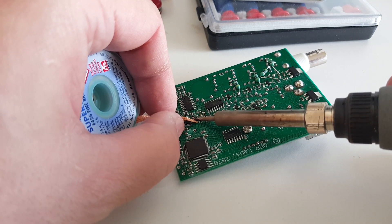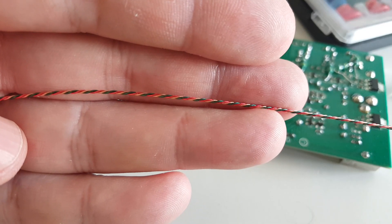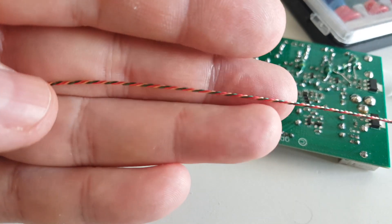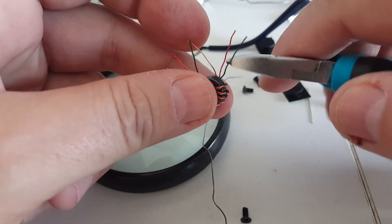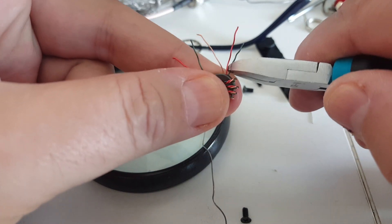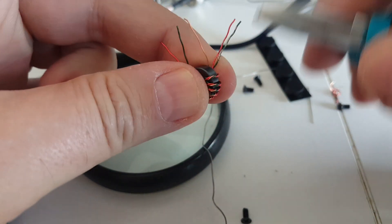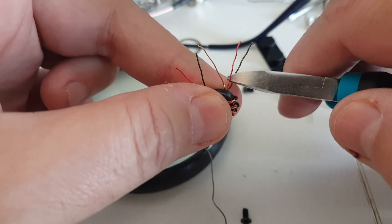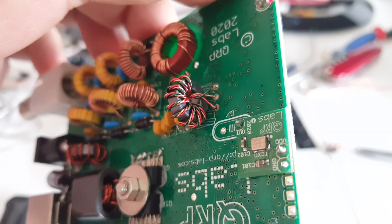I'm not sure if that's the problem — I'm just suspecting it, so we'll see. I'm also using wires of different colors here so there will be no possible mistake. Although checking the multimeter, I think I did it right. This time I'm going to scrape the enamel — I'm not going to count on the heat of the soldering iron to do the job. And I have to be very careful not to break a wire. I like colored wire because you can clearly see the copper when you strip the enamel. With the colored wires, there is no possible mistake.